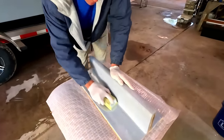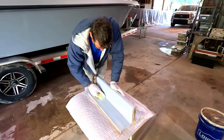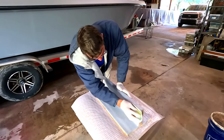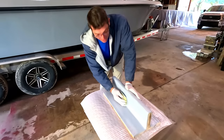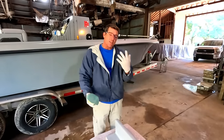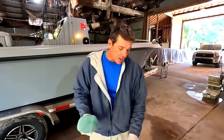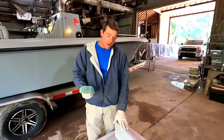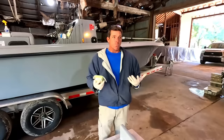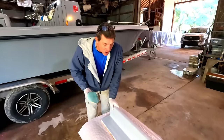Let's spin this around — same deal, just going to take a quick minute and knock some of the burrs off. This will pay dividends. This kind of stuff makes your job look so much better if you just take a few minutes. Obviously wearing a mask would be a good idea at this point. This is also a good time to ask — if you're enjoying the content we've been putting out, all the how-to gel coat repair and fiberglass work, hit that subscribe button, give us the like, share, tell a friend. The more subscribers we have, the more of this content I can do.